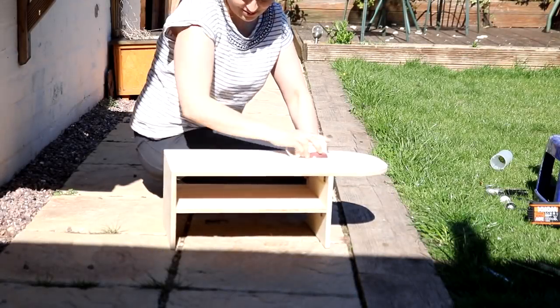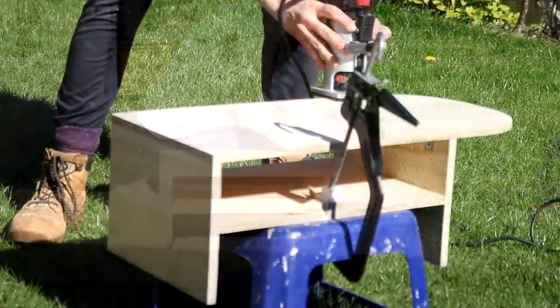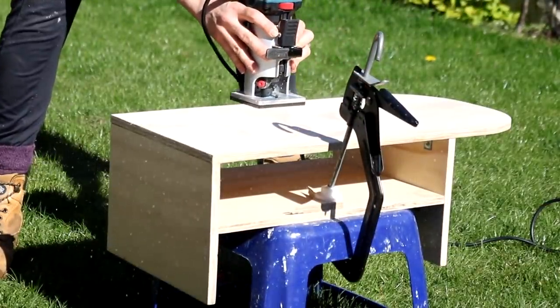As I got close to finishing, I hand sanded everything with 120-grit sandpaper. To match my treadmill desk I also went over the top edge with my 45-degree chamfer router bit.